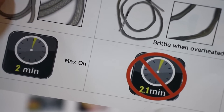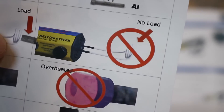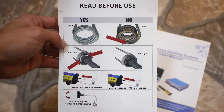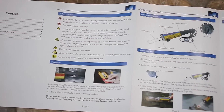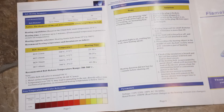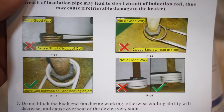The device should not be operated continuously for more than two minutes, as the inductor may overheat since it lacks water cooling. If the insulation of the inductor winding is damaged, an interturn short circuit or a short circuit through the workpiece may occur. Nothing serious will happen, but it's better not to tempt fate. The manual also includes information on the heating time for bolts of a certain caliber to 300 degrees Celsius, and how to properly position the workpiece in the inductor.